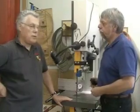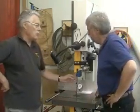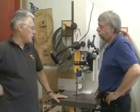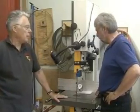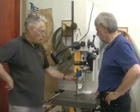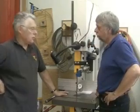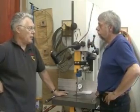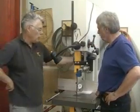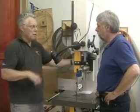One of the most critical aspects of using a bandsaw is obviously the blades that you use. Usually when people have trouble with bandsaws they think it's the saw, but often it's the blade. The blade gets dull, you have to push too hard, you're wondering whether you're using the right kind of blade, the right number of teeth. And of course there's the whole question of tensioning the blade — there's a wheel on your saw that allows you to tension and tighten it.